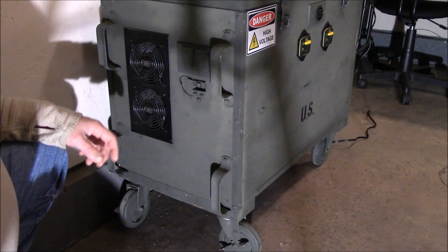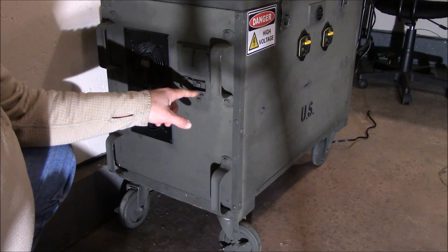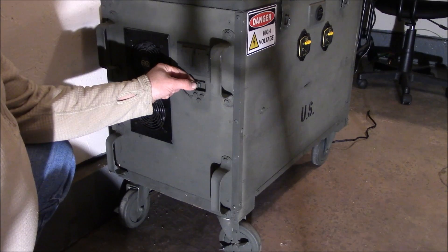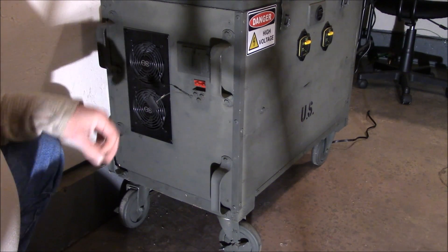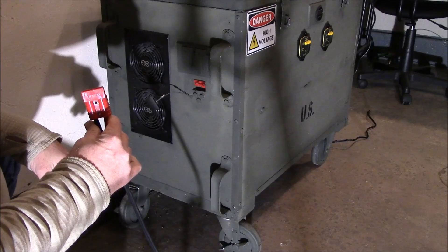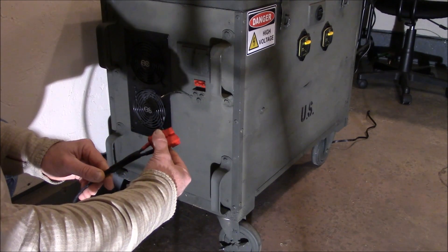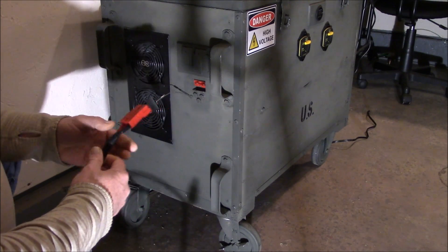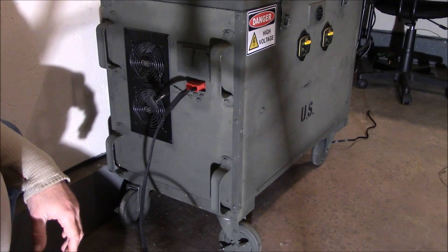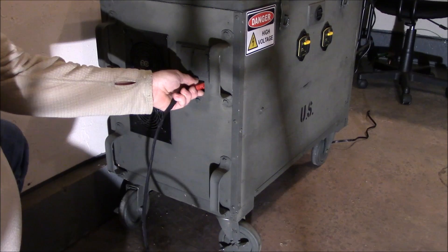Take a look at this. I had to take off this handle here and this electrical outlet here to get the jigsaw in and cut this hole out. I'm going to put the little wire rope connector protector deal on here, and there is the Anderson type 50 amp connector. Here's the cable for the PV wire that I made, and I also ordered some heat shrink for this to make a boot for it so it will look a lot better. This just plugs in just like that - that turned out really good. I had the L bracket on the outside and it just didn't look right, so I moved it to the inside.